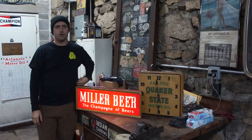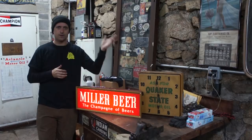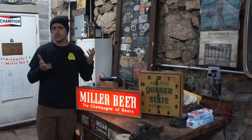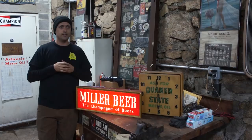What Matt actually has are some old light fixtures, probably from around the 50s — they came out of a paper mill he went picking at years ago. He put them on a skid and kind of mothballed them until he had the shop they were perfect in. They were T12 light fixtures, which is very antiquated and they don't work well in cold weather. They stop working anywhere between the 50 to 60 degree range, so in a garage it's not ideal unless you have a well-heated space.